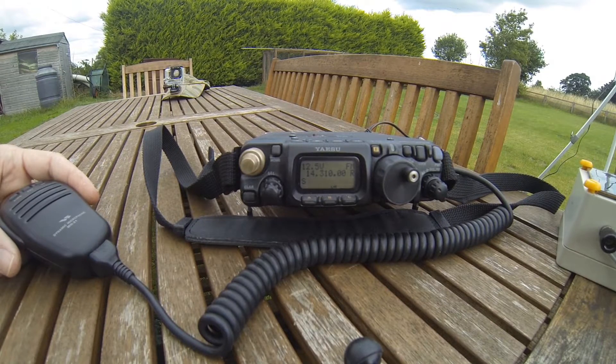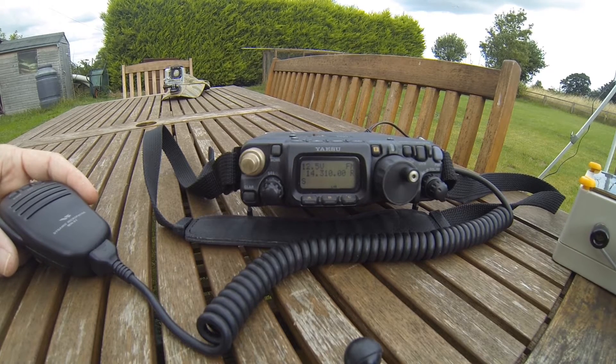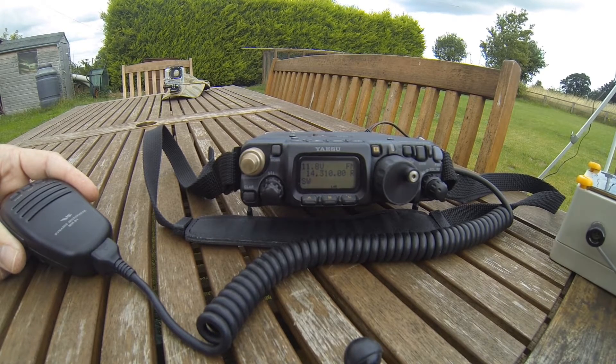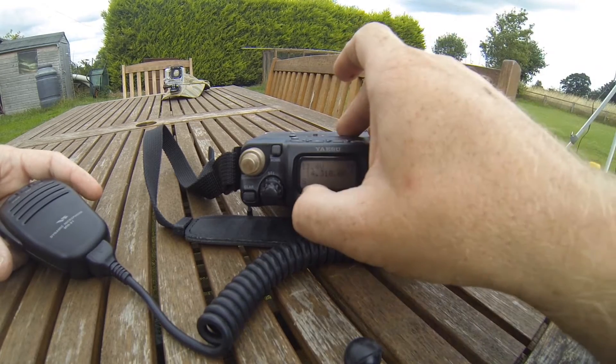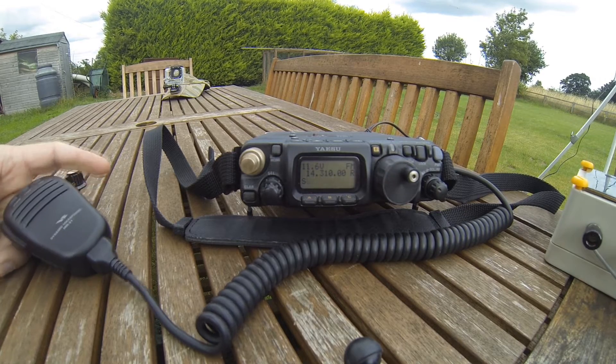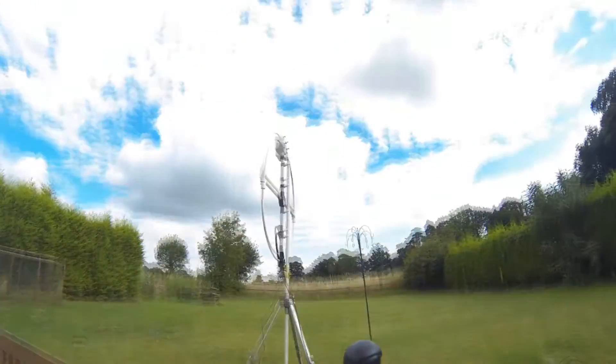Right YouTubers, I'll show you how I'm going to manually tune it with this little gizmo box. I've got it on FM, it's on two and a half watts. I've got it set on SWR so it's going to show me what the SWR is. I'm going to flick the switch and attempt to stop it on the lowest SWR. I'm on the box - three or four pushes of the dial managed to bring it down to zero. A little tiny fine tuning - just by flicking the switch I can tune the loop which is sitting over there from here.